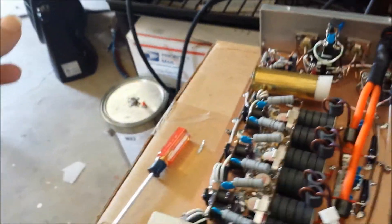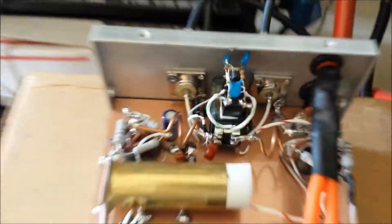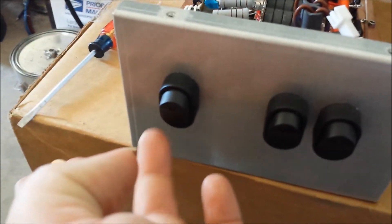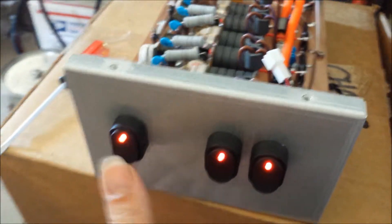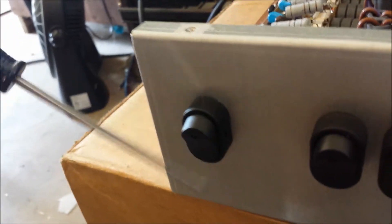This was AB biased — you can see where the solder was. It was AB biased but at the last minute the guy changed his mind. So we just have a delay cap in there for sideband. You got your four switches there, on and off — preamp, sideband. These switches are a little different than I normally use. You had to have power going through them to turn their lights on and off. On sideband, you're turning the ground on and off, so that light wouldn't work. So what I did — you see this extra relay right here? That relay is actually acting as the switch for the sideband delay, and this is used to turn the relay on and off so we could have that LED come on.